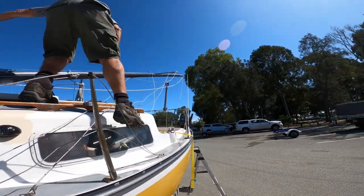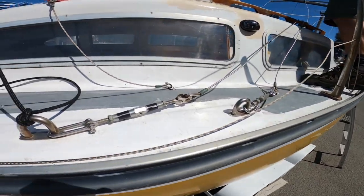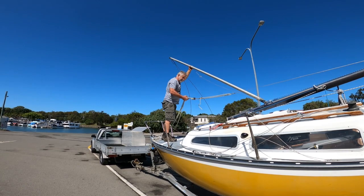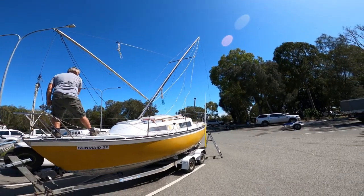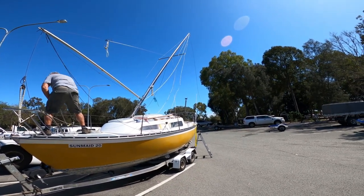Getting your lifting system all sorted out is one issue. The next thing is making sure everything's lined up. It's very easy to bend your turnbuckles or even snap one off if they snag on the way up. So it's good to have someone spotting as you're actually pulling it up. In this case, my spotter is using the camera.